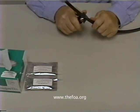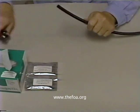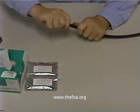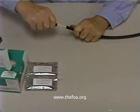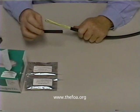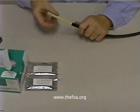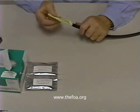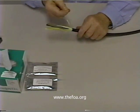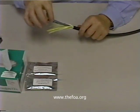Check the depth of the jacket at the end. Make a test cut about four inches up. Break the jacket — it will be fairly hard to pull off because of the gel that's inside the cable. It's a very stiff jacket. This jacket is not the flame retardant polyvinyl chloride that we use inside; it's actually a polyethylene, which is chosen more for its moisture resistance. Now you can see here's Kevlar, a ripcord to rip back the jacket, binder tape, and tubes.